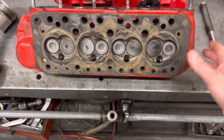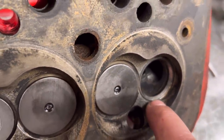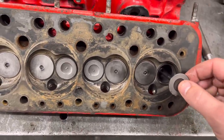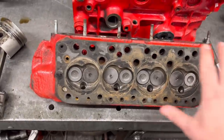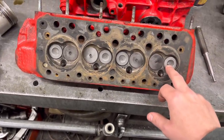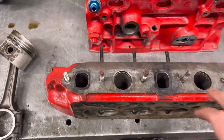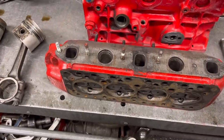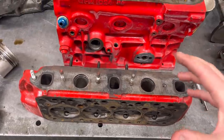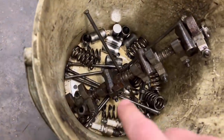We've got the cylinder head here. The cylinder head is already unleaded - you can tell that because in the exhaust ports you have these hardened valve seats put in, rather than the seat just cut directly into the cast iron. So they're all set up for unleaded. All we're going to do with that is blast it - soda blast it right back - cut the seats, blast and reface the valves, and that's good to go. We're also going to recondition the rocker shaft; we do this on all the Minis anyway, so we'll put a new rocker shaft in.